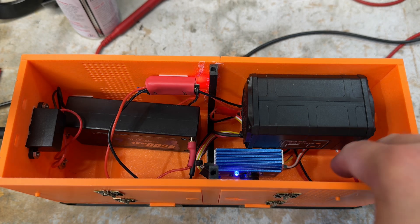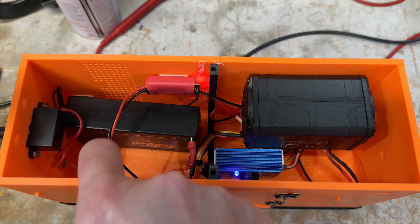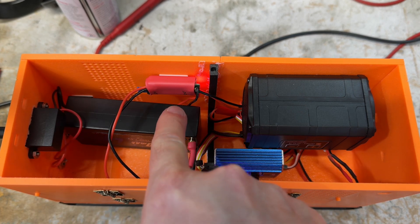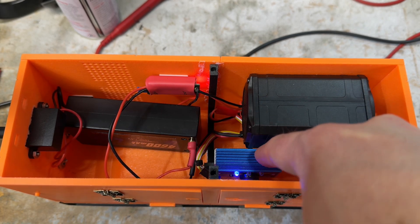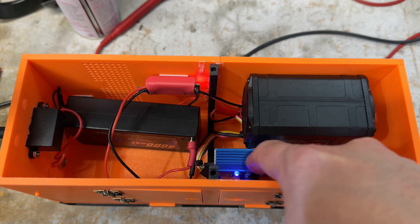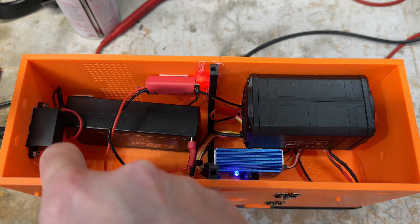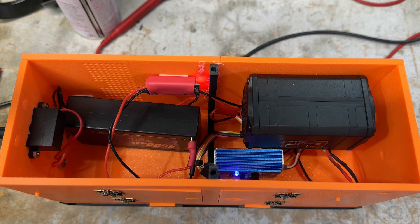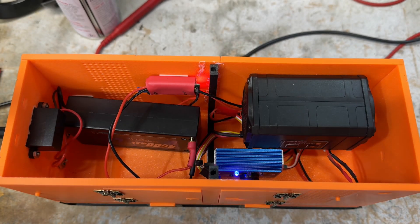At the moment it sounds like a V8 truck - let me know what you think. Just quickly with the wiring: the battery goes straight to the BEC, which regulates it down to six volts. That goes into the servo tester which controls the sound unit, but it also powers the voltmeter and the banana connectors. Basically everything is going through the BEC.